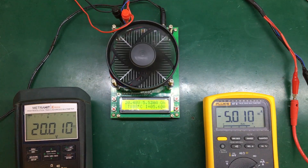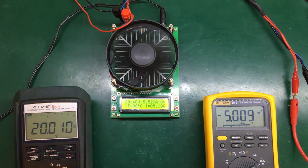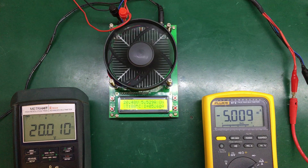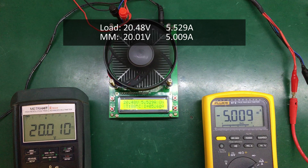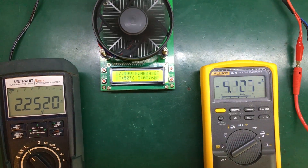Based on these measurements, we can say the load is only capable of dissipating a maximum of 100 watts at an ambient temperature of 25°C. During the test we can also observe the load showing about 500 millivolts and 500 milliamps of measurement error, which also affects the capacity value shown on screen — nothing close to the claimed 0.2% accuracy from the specs.